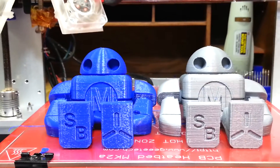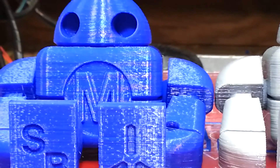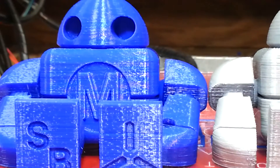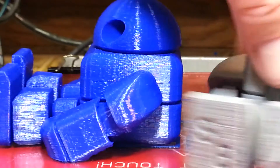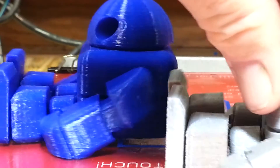Let's see if I can do some zooming in. You can see the layers on that one. Looks pretty good except for that part — honestly, this is the angle it printed at, which is less than 45 degrees, more like about 35 degrees. I should have used support material on that by all rights, but all the directions said no support material, so I didn't do it.